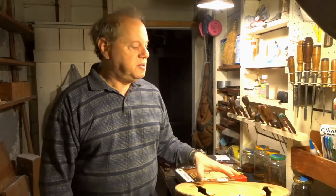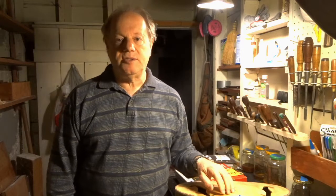I can't emphasize enough — and again, it's not my strength — that you're going to be happy if you've prepped the wood meticulously. There's nothing that feels worse than putting a bunch of coats of shellac on and realizing there's a scratch, a bit of tear-out, or some imperfection that is never going to fill in. That said, shellac fools me — there may be imperfections I think will never go away, and the shellac fills them. The flip side is sometimes little things I think shellac will fill, and it doesn't. So be as meticulous as you can, but know that shellac will tend to fill and cover some sins.